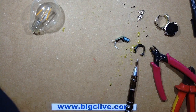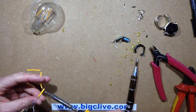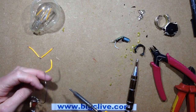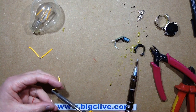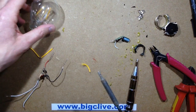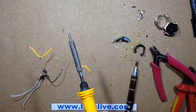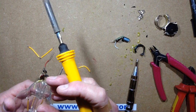Anyway, in the meantime, let's solder the LED lamp now. Do you know what I've just done? I didn't check polarity, did I? That wasn't clever. I might actually be just about to blow all these LED filaments up, because I don't know what's actually positive and what's negative.